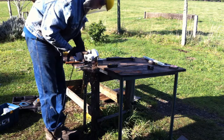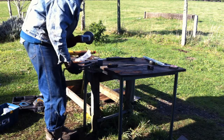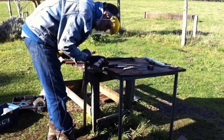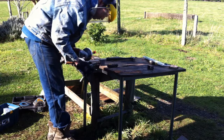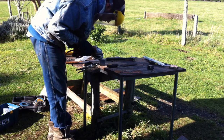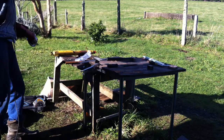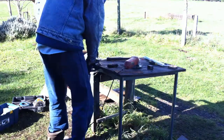After I was done welding, I took the angle grinder with a flap disc and started to take off all that weld on there — not because of looks, but because I always want to make sure that my outside edges are as smooth as possible in case a cable, string, or hose might come in contact with it. It's not going to tear up a hose or cable if it rubs on it for a long period of time, and it's also easier to keep from cutting your hands.